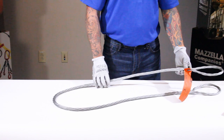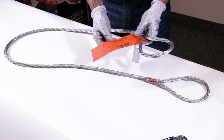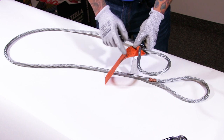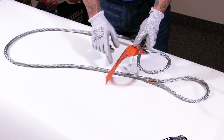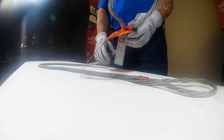What I have in front of me is a seven-part sling. I'm going to begin with the identification tag, making sure it's clearly legible and still attached. I have the name of the manufacturer, the type of the sling, different capacities for the hitches, and our serial number or code number.